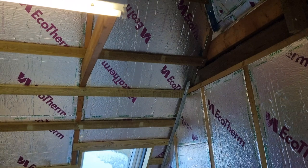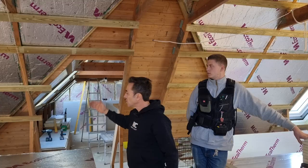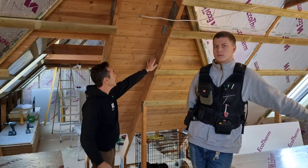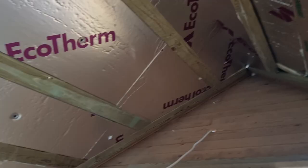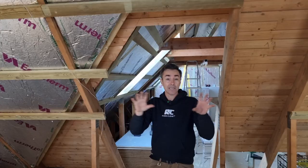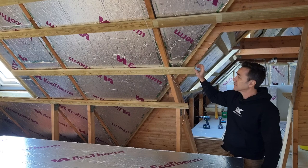We've got an envelope which is completely insulated — it's a beautiful way of doing things if you can do it right down to the wall plate, right up to the ridge. For the additional work it takes, you don't have all this complication at void walls. All of this is on the warm side, so there's no insulation here because that area is already warm. We take our insulation past where the valley lays over on the outside and then continue it again in this room as well, so we've got a really encapsulated roof.